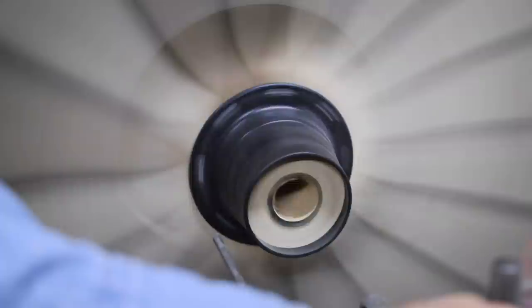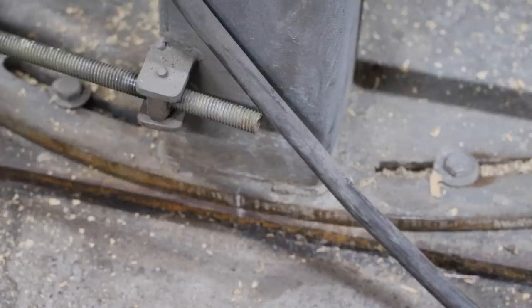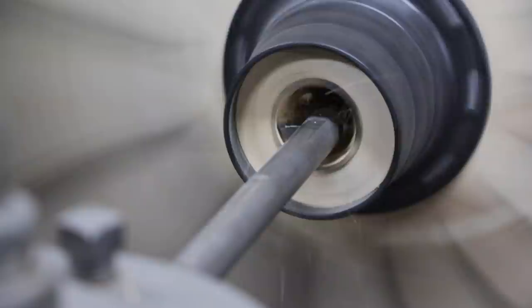This is where I'm checking that my center hole is lined up where it was originally from the other end. And now with my bit set in the boring bar, I can take my pedestal, move it to the side, and begin the taper for the boxing.